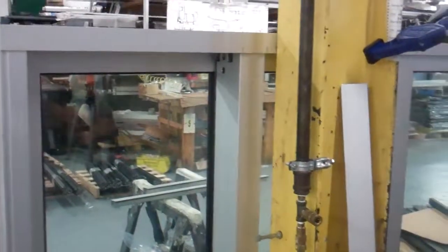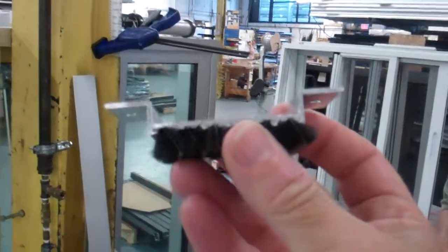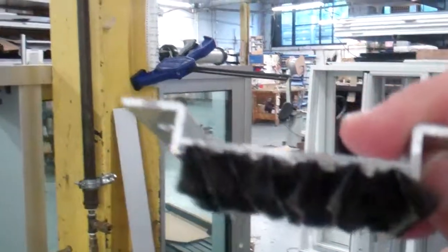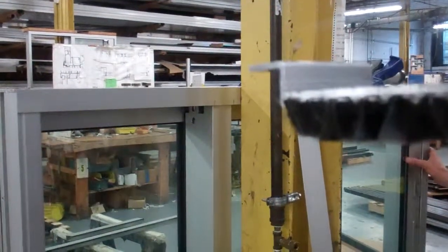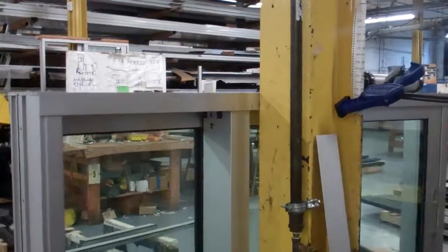The first step is to go to the inside of the frame and mark the position of where we're going to insert the interlocker barrier clip. The interlocker barrier clip is an extrusion that has multiple rows of weatherstrip, and those go into the header and lay right above the interlocker of the middle panel and the inner panel — above the sliding interlockers only.